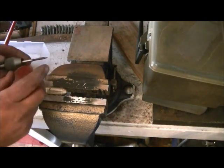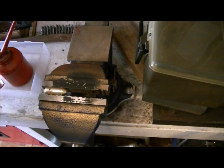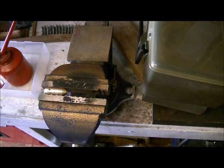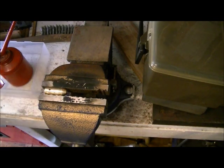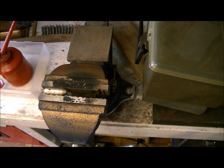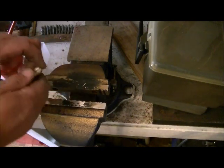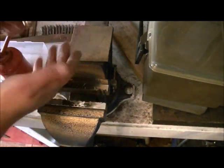But this tap has got very nice threading capability. It does a very beautiful thread. So as long as you've got a really good tap drill size, this will make a perfect thread in there without any problem. Cuts really nice and easy. So the quality of your taps makes a huge difference, and getting your tap hole size proper also helps. So that's it. We've got our hole in there.